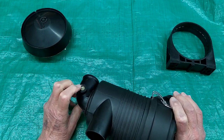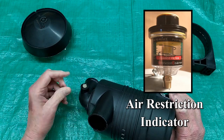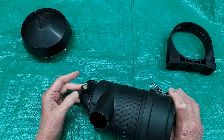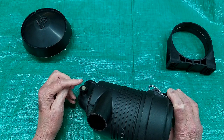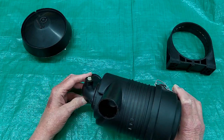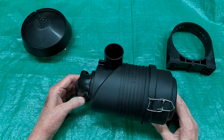In here you could install what they call a flow restriction gauge. It's a little flow meter type thing — if this filter is getting plugged up and the engine is sucking on it too hard, it will give you an orange, yellow, or red indication. If you look at it and it's still green, then you know your filter is still clean. The easiest way, though, is to just open it up once in a while and look at your filter.